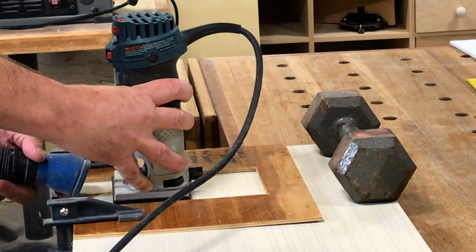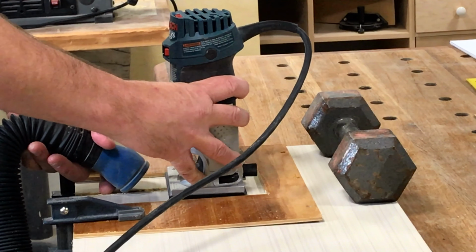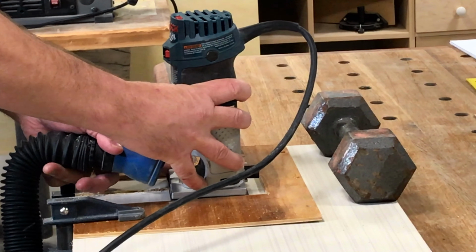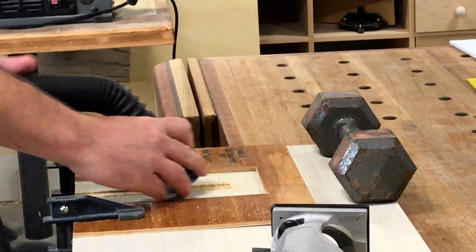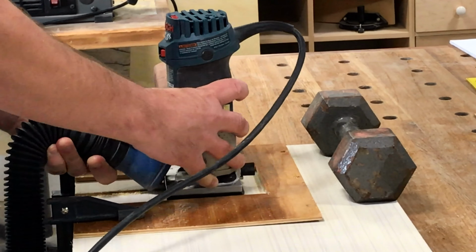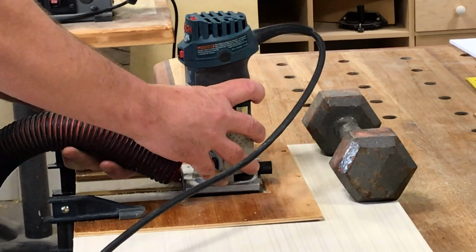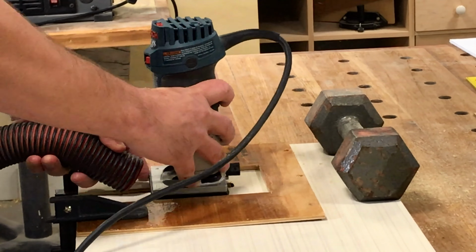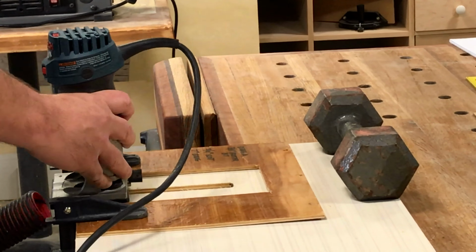It's very important if you use that kind of joinery though to make sure that the slots that you're cutting are going to be very tight, so you want to test that out on some scrap wood after I have the jig clamped onto the plywood, and taking small passes. I didn't set the depth of the router bit too deep because it would burn the wood and smoke and make a mess. So I took several passes to cut that slot in the plywood.